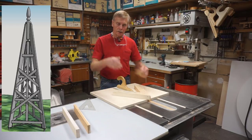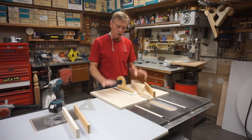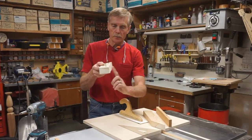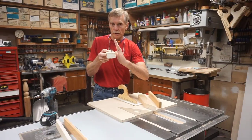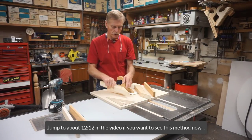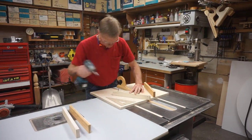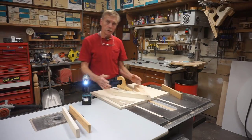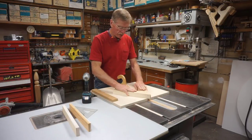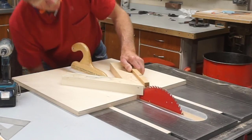From my SketchUp model and then measuring, I determined that the horizontal slats are tilted in at a little over 8 degrees. For this particular setup, I started with a blank board, laid out a 30-degree line on the board, took a scrap 2x4 and ripped it with one face beveled at the tilt angle — about 8.2 degrees. Then using the miter box with a 45-degree fence setup, I cut a 30-degree sharp angle on the end. It's then a matter of placing the block with the beveled edge on the layout line so that the long point extends to a position where it'll be cut by the blade. I did the same with another piece, cutting this angle opposite and positioning it on a 30-degree line going the other direction.